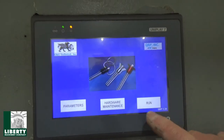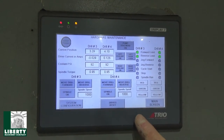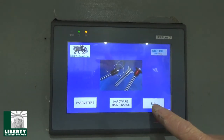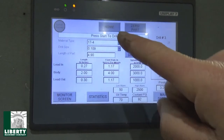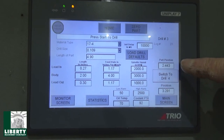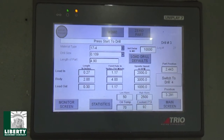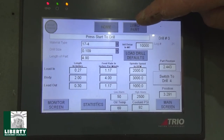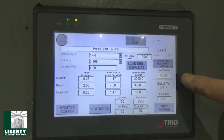Back to main screen. We're in hardware maintenance. Let's get into the run screen. Here's where I need home and zero parts. I've already homed it — that's happy. See my part position? That should be zero to start an auto cycle. I'm on drill three. I want to zero the part — I'm going to hit it right now. Even though the head doesn't move, it just tells it I want it to be home here. I'm going to hit zero parts — and that should go to zero. There it is. There's zero.